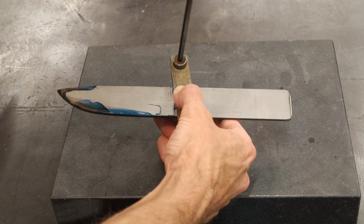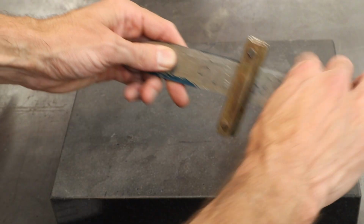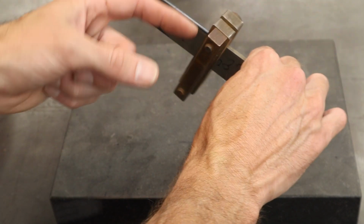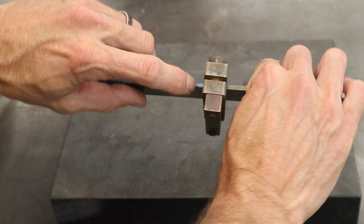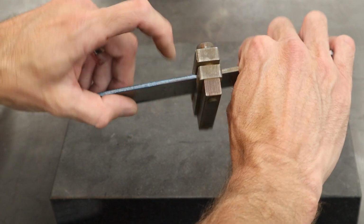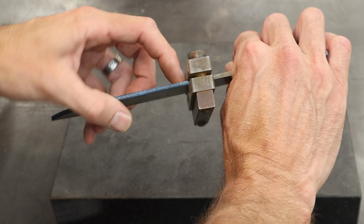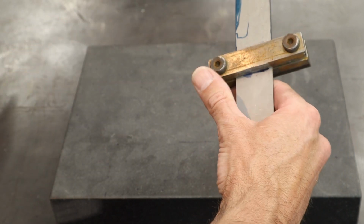And this will be my bevel jig. This is my plunge line guide. When I'm grinding, I can bump it right up against the platen, and it's going to give me a grind line up this side and up this side that are both even and equal, so that you have perfect symmetry between this grind and this grind here in the middle. They'll meet, and they should be at the same place on both sides. So this is a really handy jig to have right there.